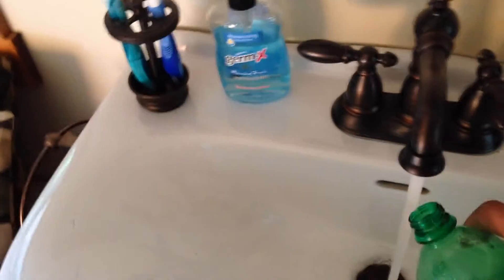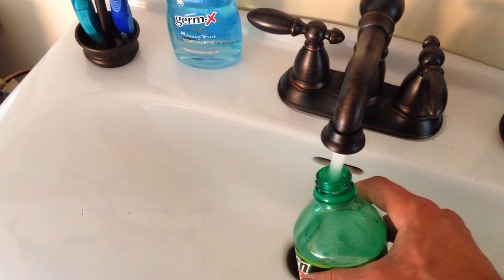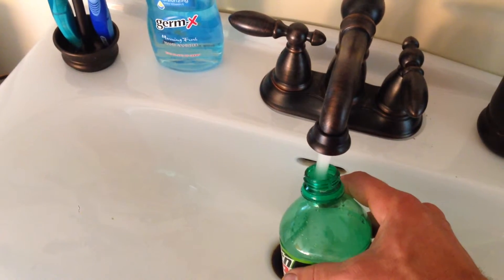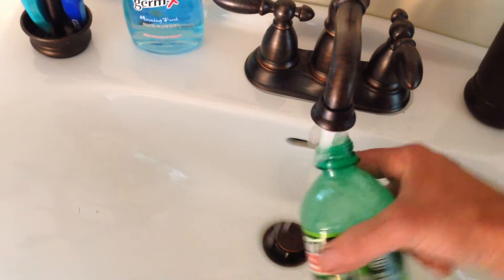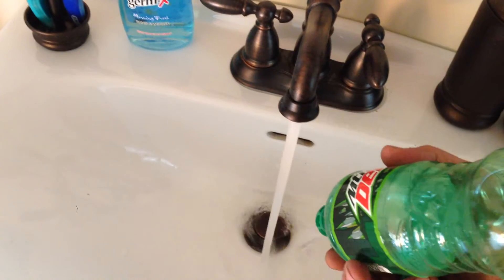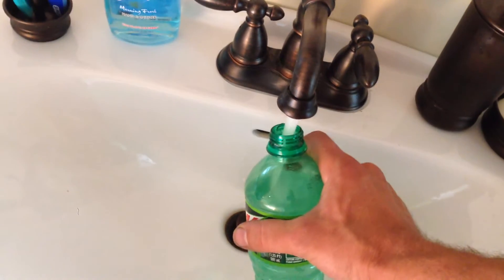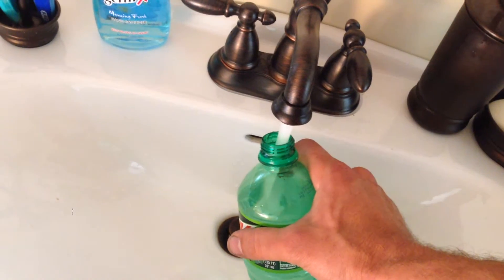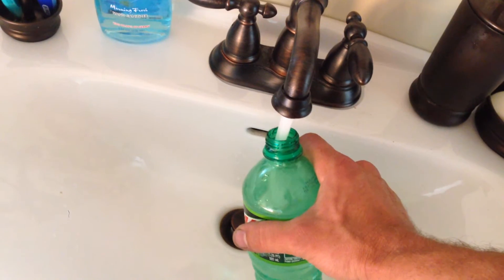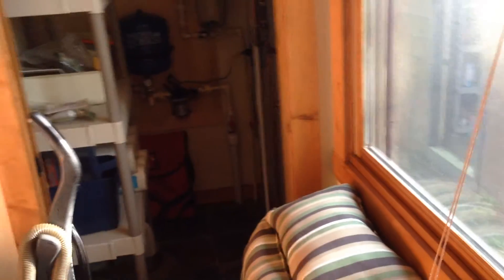And that is where we are running our water right here in the bathroom. That pump is really keeping up. This is the first run — it just ran for 10 minutes. That's what you do when you first install that ceramic filter: run it for 10 minutes to flush it out. Yeah, it's all set. It's got pretty good flow. Just filled up this little can, shut it off, and yep, pump just shut off — it's back up to pressure.